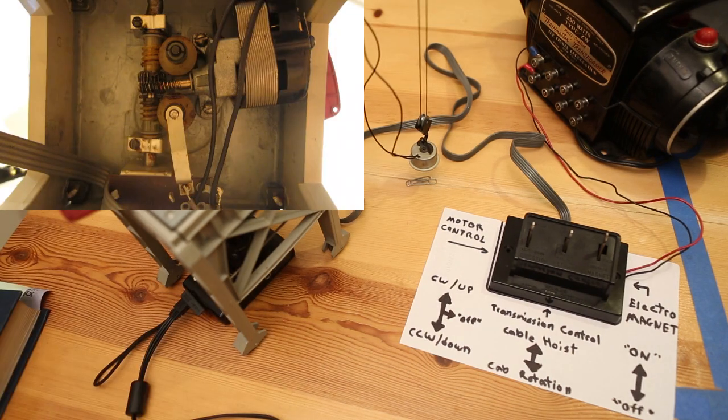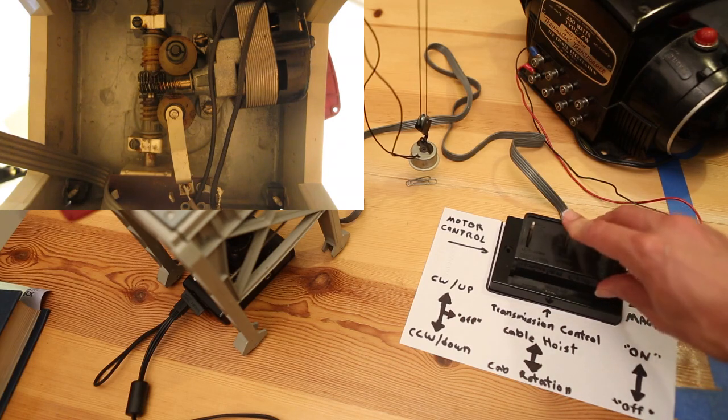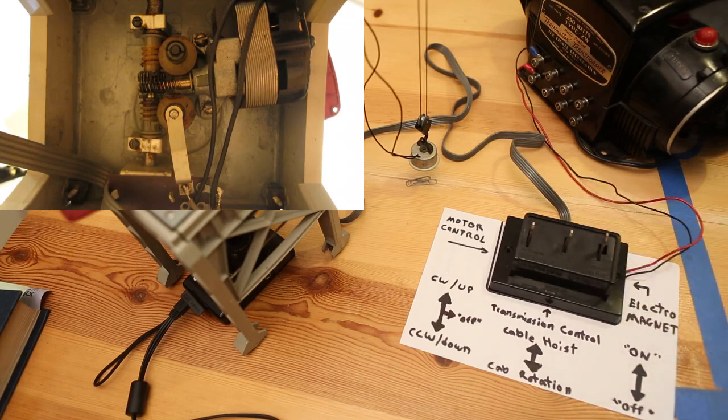For starting the gantry crane demonstration, I'd like to show you what happens when the transmission is switched. When the center switch is set to the upper position, a solenoid located beneath the crane and next to the motor will pull the gear axle, causing gears between the main motor and the gears for the winch to mesh. When the center switch is returned to the default position, the solenoid is disabled, and a spring returns the gear axle to its normal position where the gears between the main motor and the cab rotation gears mesh. You will note the movement for the gear axle is very slight.